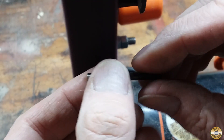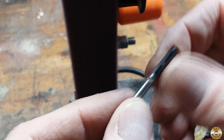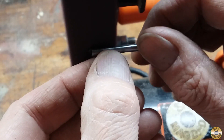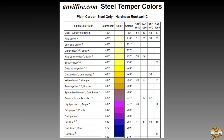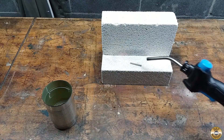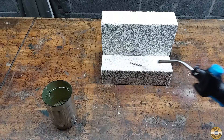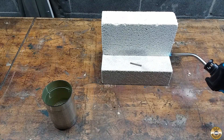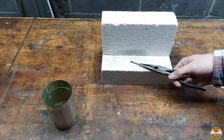I brightened the metal on two of the quenched pieces. Tempering involves reheating the quenched part up to a specific temperature much lower than the critical temperature. You can temper steel by color rather than measuring the temperature. That's why I took a minute to brighten the pieces, so I could better see the color change as I reheated them. Once I saw the color I was after, I quickly dunked the piece in water. This wasn't re-quenching, just me stopping the color change where I wanted it.